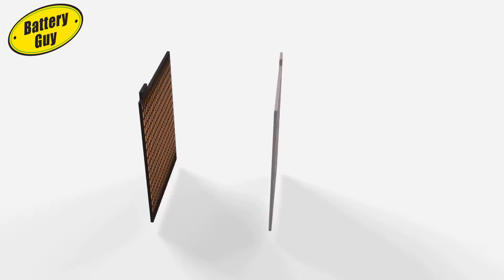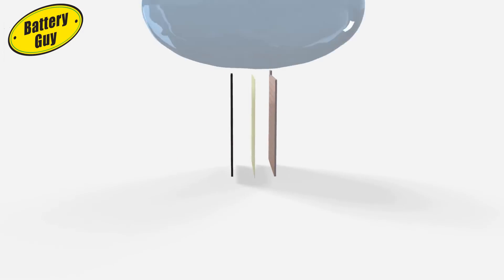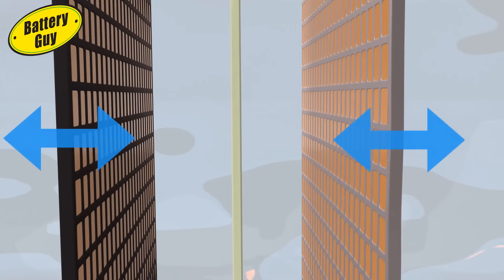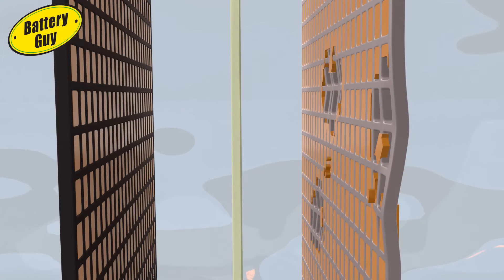The plates are lead-based, but lead is a soft metal. When placed in electrolyte and connected to an appliance, the chemical reactions push and pull at the plates. The more discharged the battery becomes, the more likely they are to buckle and lose their shape. Small buckling causes the active paste to fall off, reducing how effective the plates can be at giving and taking a charge — reducing the battery's performance and its overall lifespan.